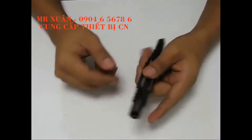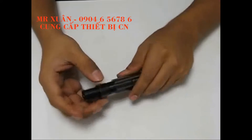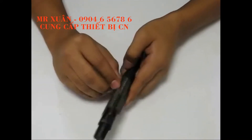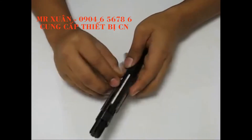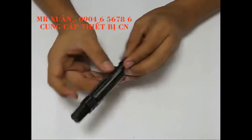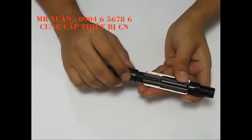To make the reamer larger, simply twist the top nut up to the desired size and then slide the blades up to the nut. The last step is to twist the bottom nut to meet the bottom blades.